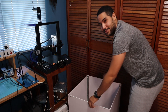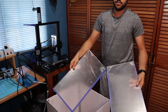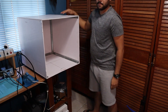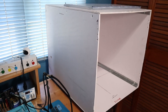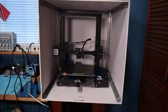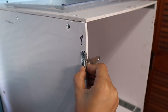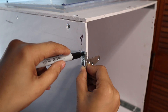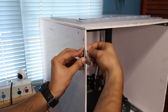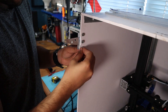The enclosure is actually really really light — super light. For the hinges, I measured two inches from the top and filed away 1/16th of an inch to allow the plexi to sit flush with the front of the enclosure. I placed the hinge back, marked the holes, and used the same 3/16-inch metal bit to make holes in the PVC. I can't use rivets here since there's no metal on the inside, so instead I'm using 1-inch screws and nuts with a washer on the inside. I repeated this for all four hinges.